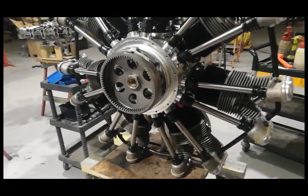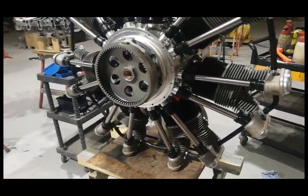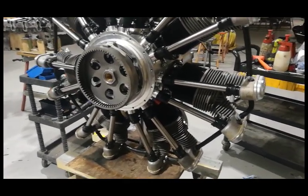The problems start when you actually drive through a hydraulic lock on the engine's power after it's fired. That's where it gets an enormous amount of power - a lot more than the starter motor - and that just bends itself.